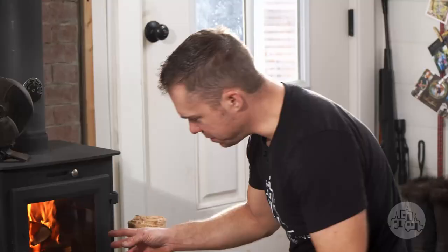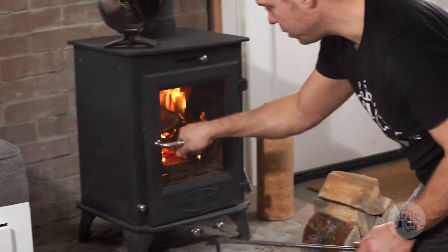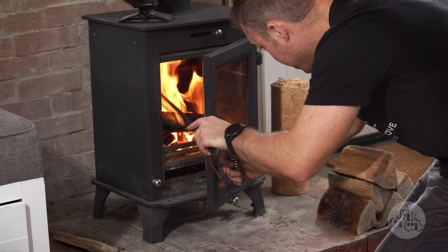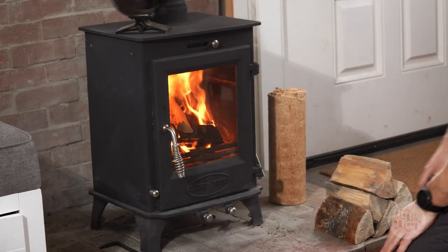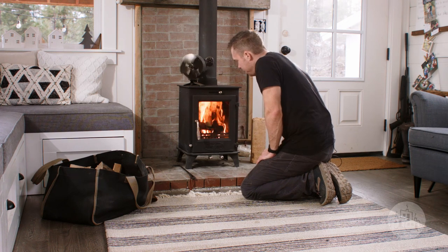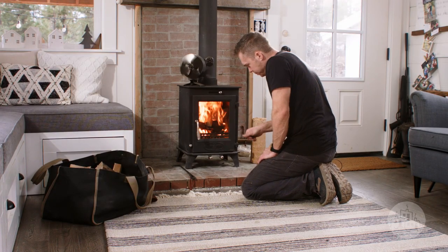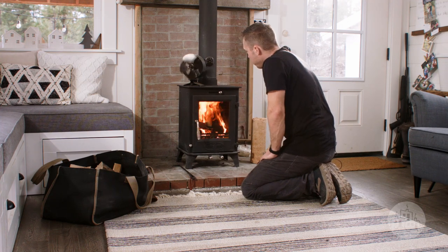I have a good hot fire. Some of the initial stuff I put in there is just about burnt out and my log cabin is about to knock over, so I'm going to help it out. I'll crack the door, take my tool in there, get that shifted, and maybe add another piece of fuel. Once new fuel is added on and it's charred black, this is the point in the burn process where I can shut down that primary air and just use the secondary for a more efficient burn.